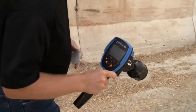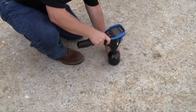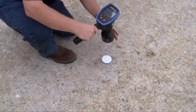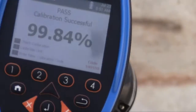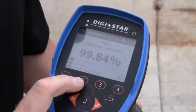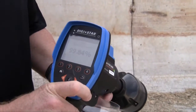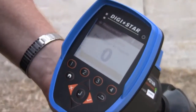To check calibration, I set the disk on a solid surface and hold the sensor on the disk so it doesn't move, then push one to check the calibration. As long as the result comes up at 99% or more, you're okay to take samples. If it's below 99%, it's going to ask you to recalibrate. You would do the same procedure — hold the unit on the disk and press two — and it'll take about 45 seconds to recalibrate. Now that we're calibrated, we can go back to the measurement screen and we're ready to begin sampling.